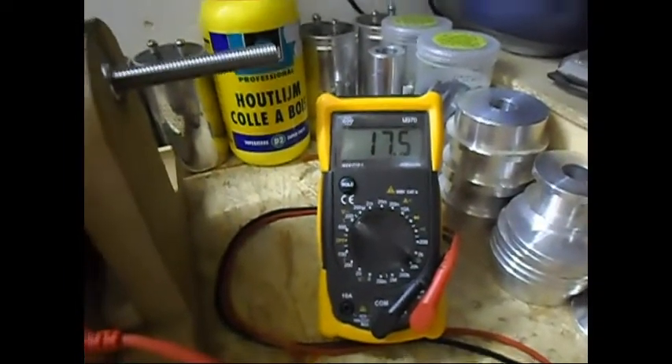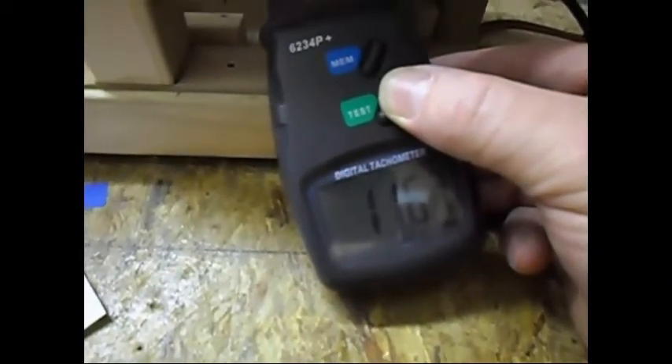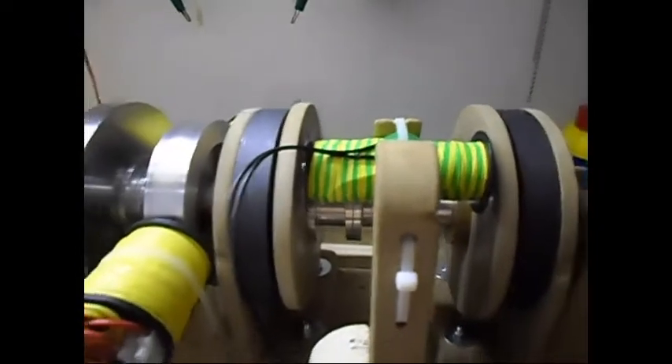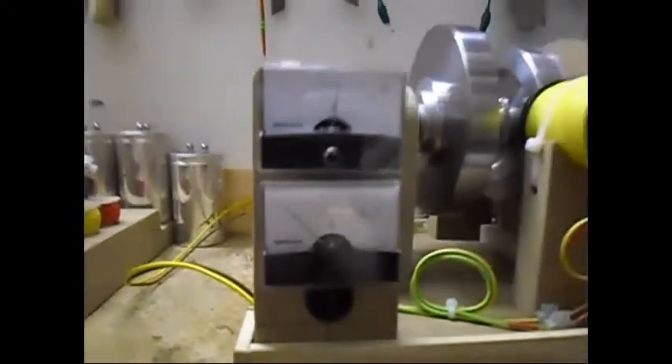Gonna remove the short now. I have 17.5 volts — this should drop also because the speed is decreasing. Last time I measured it was 1178, and it is now decreasing: 1169, 68, 67. As you can see the voltage is also decreasing. Another good test. The output is basically the same as the smaller coil — but this coil gave me speed on the load when it was shorted. The input is still 16 volts DC at roughly 30 milliamps or lower. Hope you enjoyed it, thanks for watching.